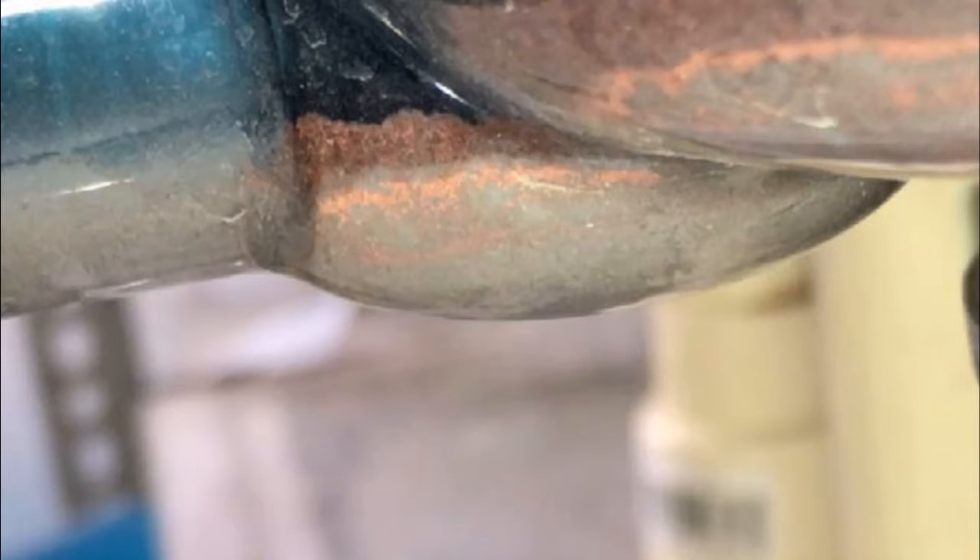This isn't the best example, but you can see the plausibility of the idea is definitely there, so it's worthy of further testing. The stratification clearly shows we have a bottom layer of anode sludge and possibly some 304 stainless steel with rubber powder, then a copper layer — that's the copper powder that started to produce when the anode active surface area fell below the plating threshold — and on top of that a possibly iron-rich nickel/copper powdery substance. The stratification is working and separation will be easy.